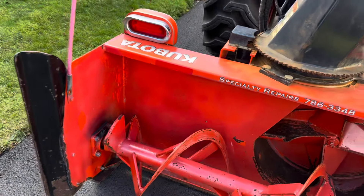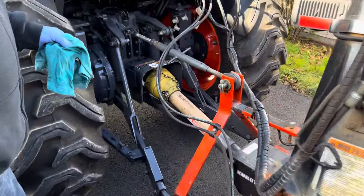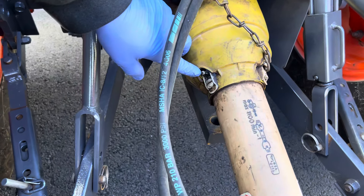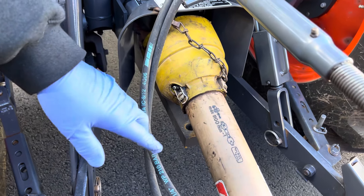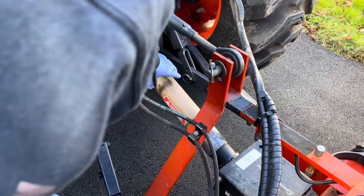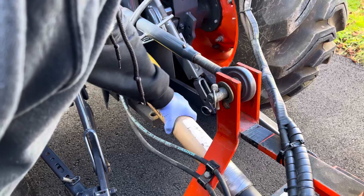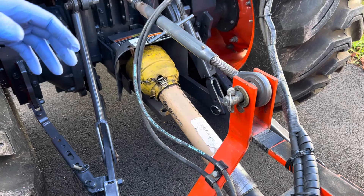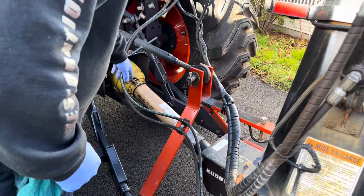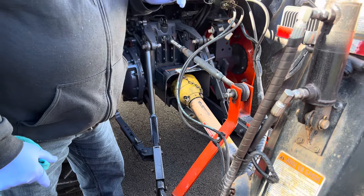Once you get them greased, you need to concentrate on your PTO shaft. If you look at it closely, you're going to see a grease nipple — it doesn't look like a grease nipple, but it is. It's on both sides. That's a collar, a plastic collar inside, so this can spin back and forth. It's on a chain to keep it from completely going around. If you're ever in your tractor and your snowblower starts to make a squealing noise, nine chances out of ten it's because these points have gone dry. So keep them greased.